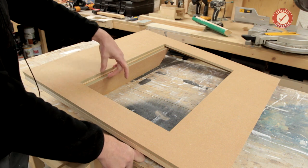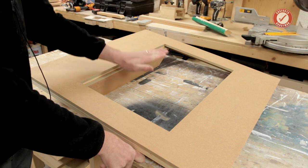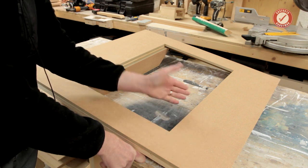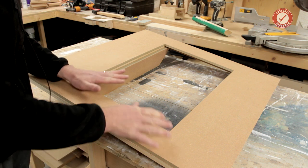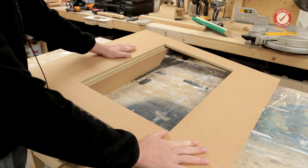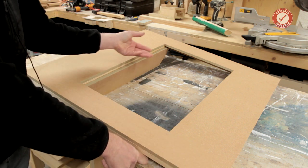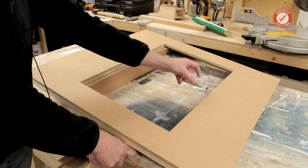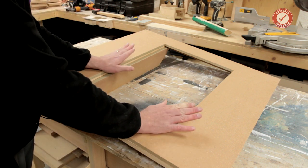The door needs to be made of 18mm MDF whereas the panel itself is made out of 12mm. Generally it's not a good idea to mix and match your face panel to a different thickness from your door, because you run into all sorts of problems. But in this situation I haven't really got much option — if I make the unit out of 18mm MDF it's going to be really heavy, and if I make the door out of 12mm MDF I can't use normal euro hinges. Having an 18mm door will also make life easier for the lock hardware.